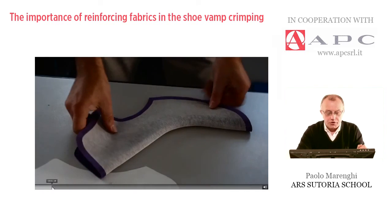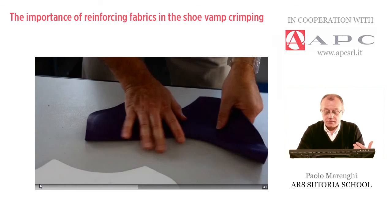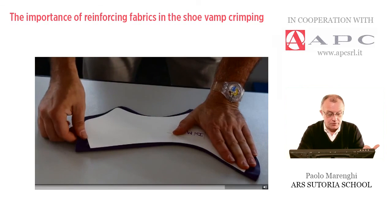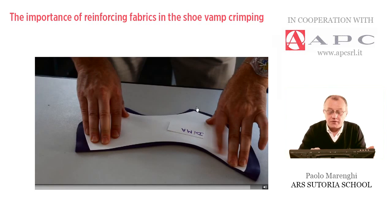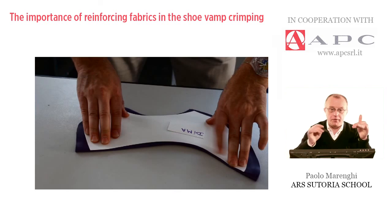The operator is showing a very good result. He is placing and checking the curvature, which is good and satisfactory. But the problem is that there is too much material on the toe — too much allowance given to the top. It's a mechanical operation and it's difficult at the very beginning to predict what's going to happen to the pieces. In terms of pattern making, there is not enough allowance given to the back. So in this case, gluing is perfect, crimping is very good, but the rough pattern — the very large piece to be cut out — must be revised in order to correspond to a perfect template.